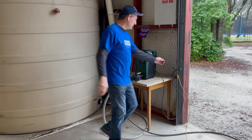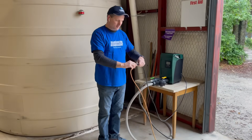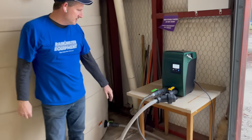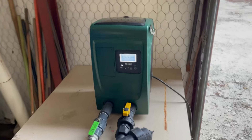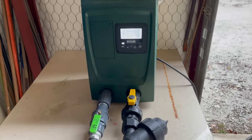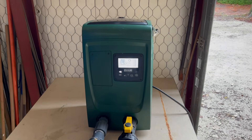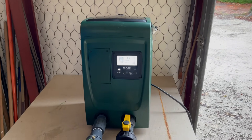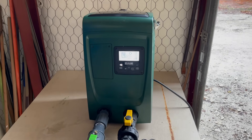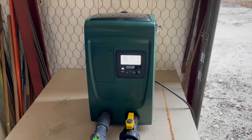It's very quiet. It's currently unplugged, but I'm going to plug it in and show you what to expect. A pump like this will predominantly stay plugged in all the time when it's being used. When there's a demand for water — like you've opened the ball valve here — it'll turn on. And there it goes, you can see it's currently running. It's currently set at 48 psi at the discharge, which is nice pressure.